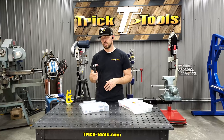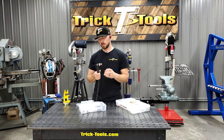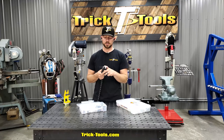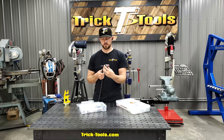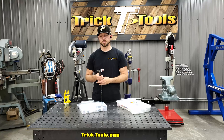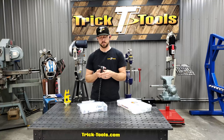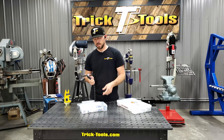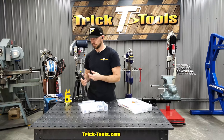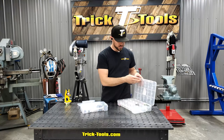If you're welding at a higher temperature, you can't always go down to the smaller torch on your machine. This is the factory torch for this Miller machine that I have, but there is the option, if you're working in tight spaces, to go down to that smaller size. However, if you're welding at a higher temperature, that's not always feasible because the torch gets really hot and it's not as friendly for high heat situations. Being able to go down to this Stubby Slammed cup will allow you to get this bigger torch into tighter spaces.